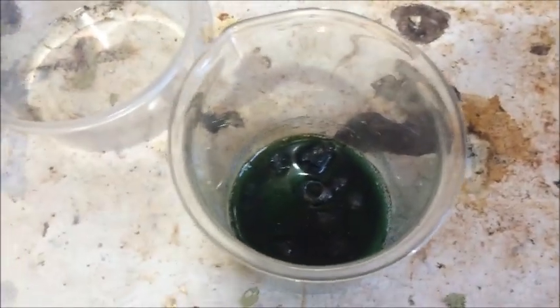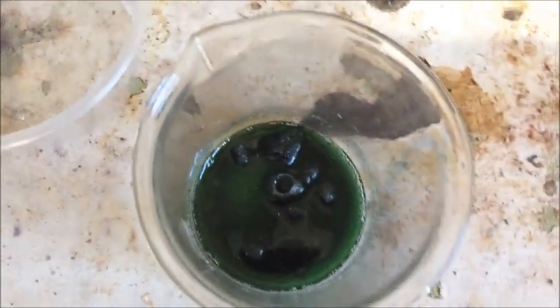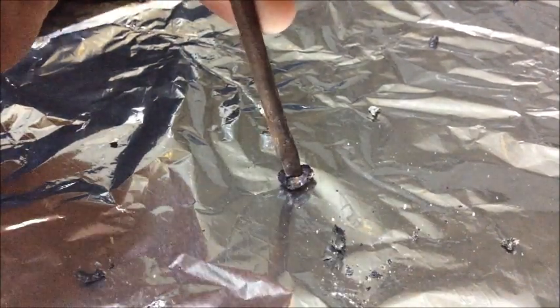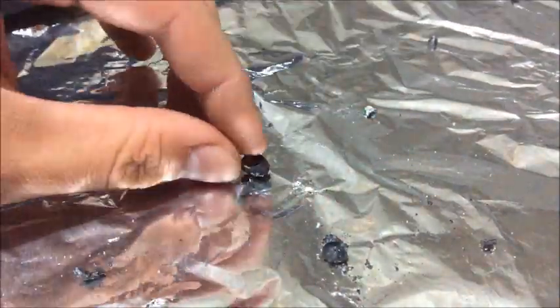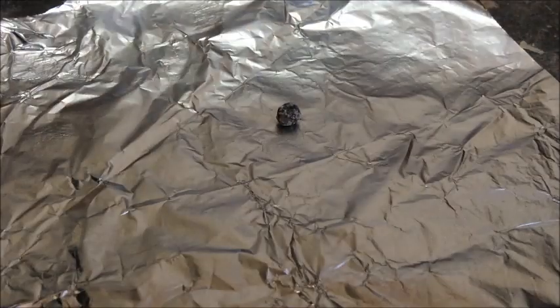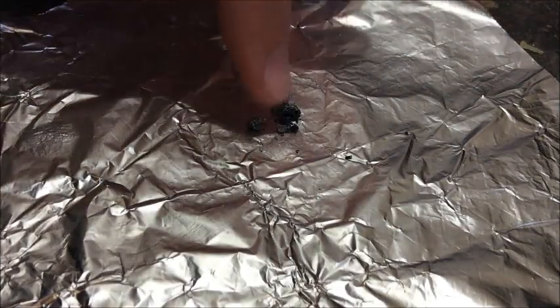I'm going to filter out these chunks and wash them. I've decided that the best way is to just physically remove all the slag and oxide with a chisel or a screwdriver and a hammer and pick out the bits of metal. This is one of the sort of circular pieces that flew out of the thermite as it reacted, and one of the best ways I've found to get the vanadium out is to hit it with a hammer gently enough so it shatters, and then from there we get our piece of vanadium out.